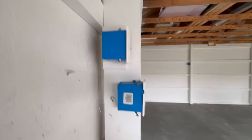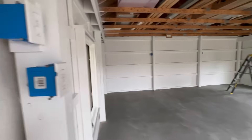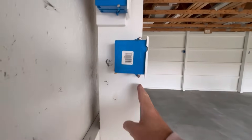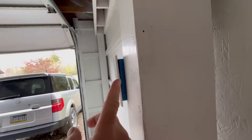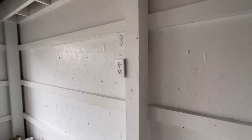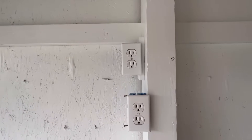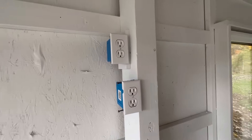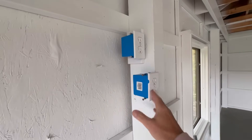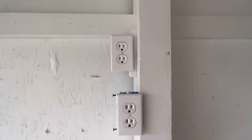Let me show you an example — I put a second one up here just lightly nailed in to show the difference. The top one is what most people put in for a standard pole building, just because it's the easiest way. You have to keep it spaced out because there are notches in the box where it rests on the beam in case you ever drywall it. In this case we'll never drywall this garage — but if the new owners decide they want to, every one of these can be moved very easily. Let me know in the comments: would you prefer it sticking out without the extra work, or put in the extra effort and recess it? What's the better option, what's the better look?